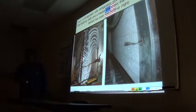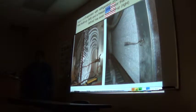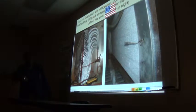But if it's in deeper, the only thing I can do is probably cut off that tube and pull the thread, and screw it, basically. I cut it off and block it off, and hopefully I get enough refrigeration from the rest. And that's where you tell your customer that, listen, you have to end up changing your blower unit as well, so start saving some money.